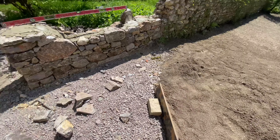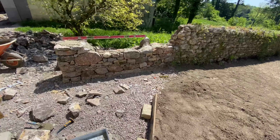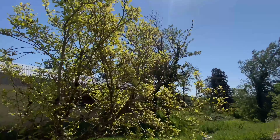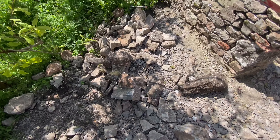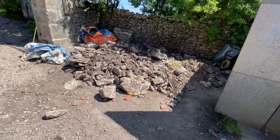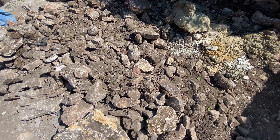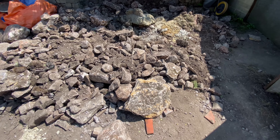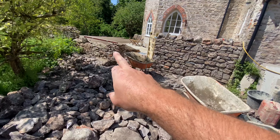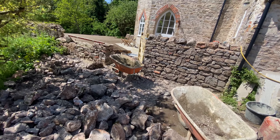You can see where I've stopped — got it flat. Especially sort of halfway up, it's nice to level off because it just makes the wall run nicely. It is absolutely stonking down with sun but warm, and this side's nice with a bit of shade. We're slowly getting through the stone — we've got some big bits here, but there's a lot of that bradstone brick that we can't use in this wall. So we're picking out the good stuff as we go, trying to keep it as similar as possible so the two walls match.